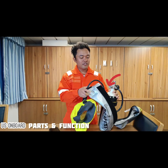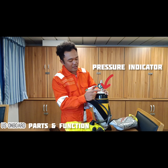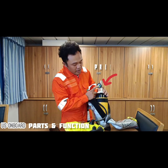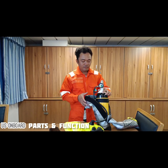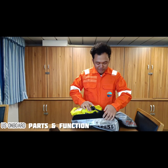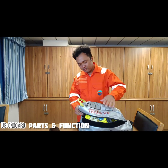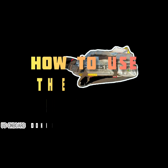The discharge hose delivers the oxygen from the tank to the mask. The pressure indicator will give you a heads-up as to the status of your oxygen tank. An audible alarm will sound once your oxygen tank goes below 30 bars. The cylinder bottle can store between 200 to 300 bars of oxygen, good enough to help you escape for at least 15 minutes.